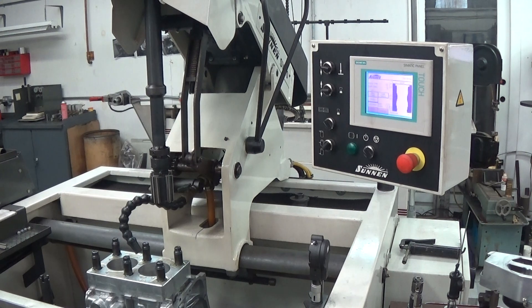Any block that you do — I also do some early Harley cylinders that are extremely blind, long blind cylinders that I sleeve or bore — the same thing: you get zero taper in those cylinders, which is impossible to achieve with any other style hone. So that's just a good intro to this type of machine and what's available. If you're not getting results from your machine shop, look for a shop that has one of these.